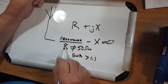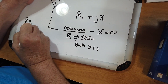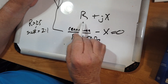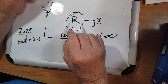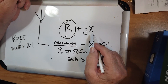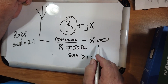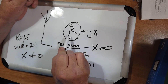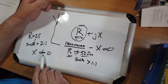Let's take the case where R is 25 ohms — this is covered in the general class manual. Where R is 25, the SWR will be 2 to 1 at resonance. This is the thing that people get kind of confused about. So if you want to tune to resonance, you get X equals 0. However, if you tune for your lowest SWR, X will not be 0. You'll have a little reactance, but you can bring the resistance closer to 50 ohms. So you're playing a balancing game here.